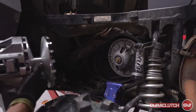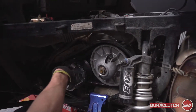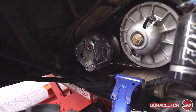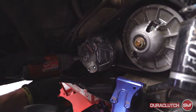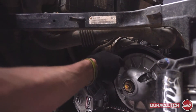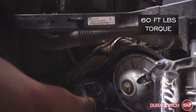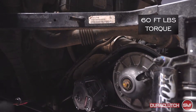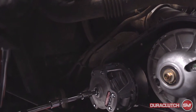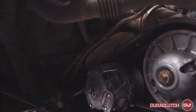We'll be able to take our new primary and slide it on the shaft like that. It's gonna go right back on with the same hardware. To get the final torque spec on the primary clutch, I actually use the puller and run it through the tower there, and then it'll hook on something down there so that it can be torqued down. Once you have that on there you can start tightening down until we hit our torque spec.